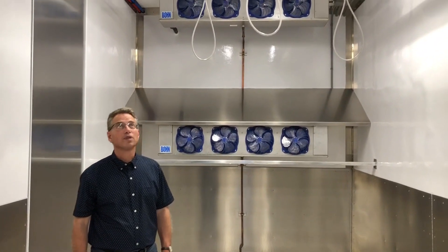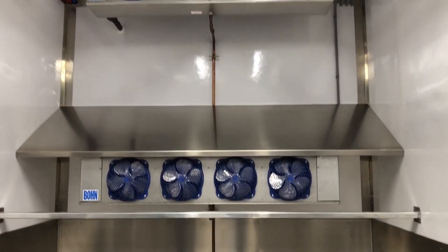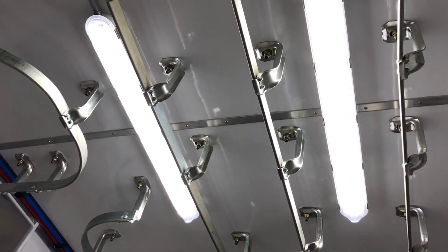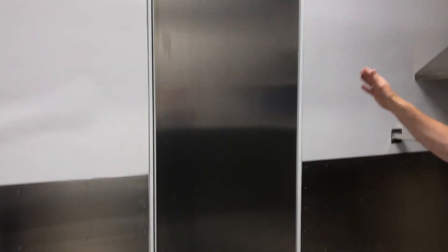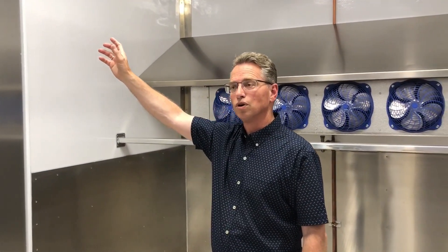Here we're in the cooler area. You can see we have two evaporators behind us to cool the carcasses down very quickly — we can go from hot beef to 45 degrees in 24 hours. We have a four-rail system so you can hang 15 or 16 head of beef in here. There is a full-height door that opens up to allow you to unload the cooler from the side. There's a coupling on the end of the rail that allows you to put a rail extension on to unload into your carcass cooler or reefer trailer.